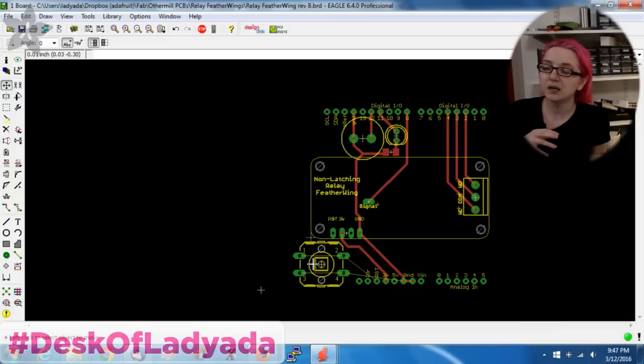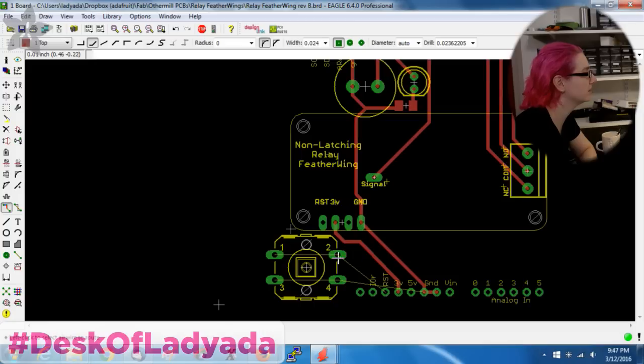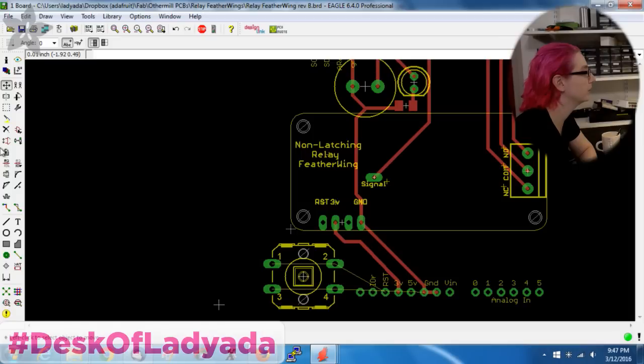Rather than have them push a button to test both states, especially with the latching relay, it's a little bit more complicated, because I want to have maybe an LED visualization test. So yeah, this one, honestly, you probably could have just a button, you press the button and it just tests the relay, and when the relay lights, it alternates LEDs. But I'm still going to do this, because when I'm done with the test, I want it to also light up the LED on the board and have the person look for it. It is a little bit overkill, but we have a lot of Arduinos, and I like this sort of standardization that we've come up with for testers. So that's why I'm going to stick with this.